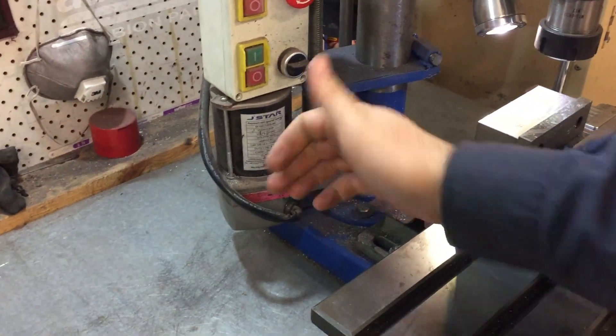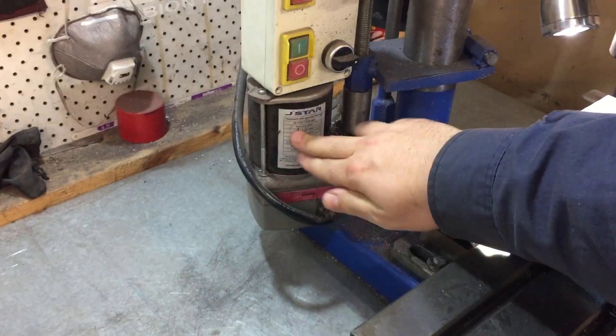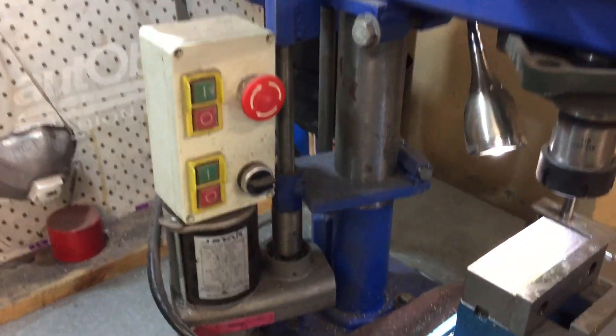It's the rise and fall motor. So when you're on a treadmill and you want to incline to work harder, this is the motor that does it. It's a good choice because it's a 240 volt motor and already had forward and reverse polarity, so it was easy to hook up.